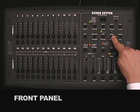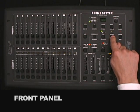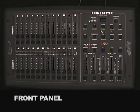The add kill record exit button. This is a multi-function button. The add function allows for multiple scenes and chase playback. The kill function is used to momentarily black out all channels except for the bump buttons or group of bump buttons selected after kill has been selected. The record exit function is used to exit record mode.